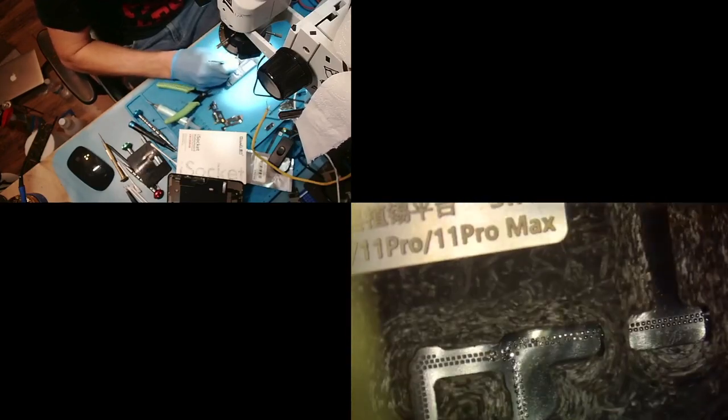All right, we're gonna move along. We're gonna bring them down. And again, we're holding down with our tweezers so our stencil doesn't flip up. See, like over here, it's all picked up, and that's kind of what it looks like. So we're gonna press back down, and we're gonna add some heat. Gonna let these balls solidify on the pads, bring away our heat, move the board heater, and we're gonna keep them coming, bring them back down over here. Come on now. Solidify properly. Don't make me look bad on the live now, come on.